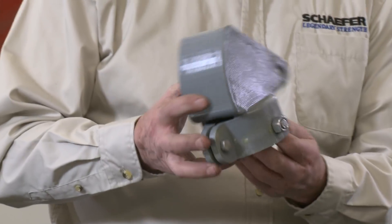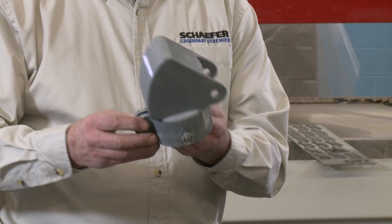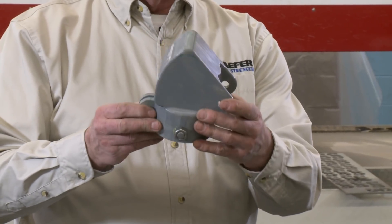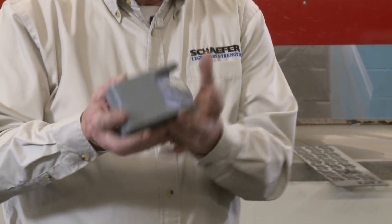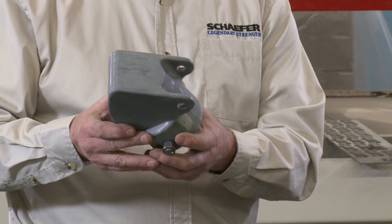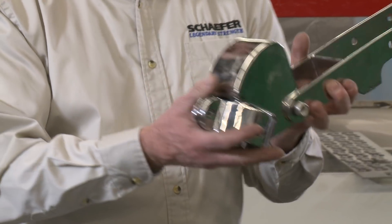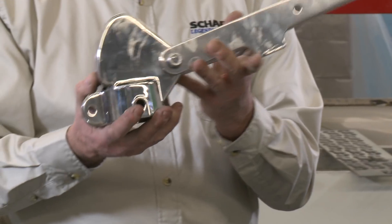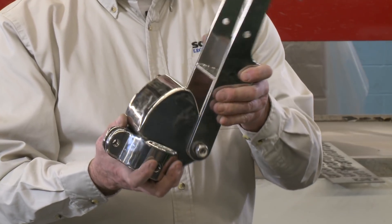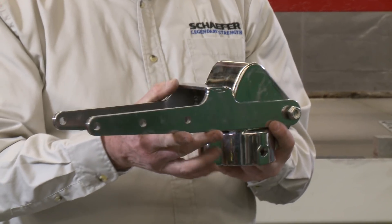This is how we did it: we designed it, put it on SolidWorks, and came up with an SLA plastic part made in a 3D printer. We made some changes to the ears and other things to make it sleeker, changed the radiuses, and tried to keep it in a design that would not catch ropes. The final version was a beautiful polished stainless steel piece — we took the drawings and had an investment casting mold opened to get these parts, and they're gorgeous. That was a happy accomplishment over this last six months of work.